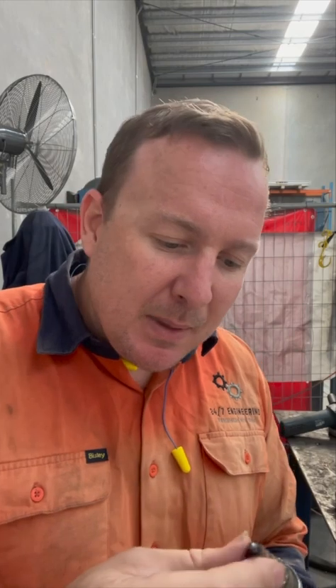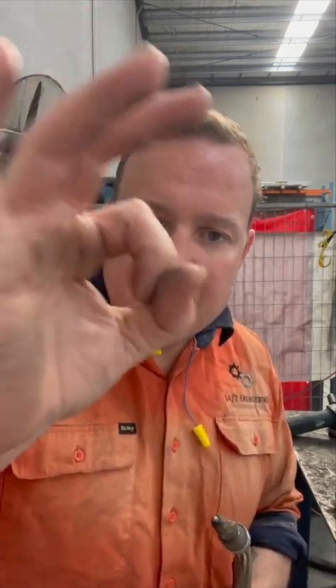It has to hang inside the shroud about five mil — if it doesn't, the wire sticks to your tip and you'll blame the gun. One more thing: copper expands when it heats up. So if you have a 0.9 or 1.2 tip depending on what you're running, you go from a hole like this and when it starts to expand it starts to close up like that. So you either replace the tip or you bore it out.